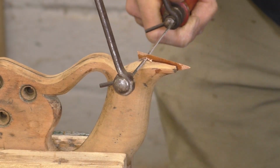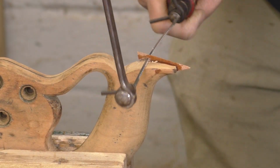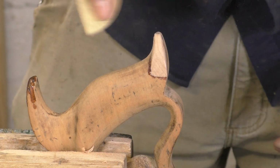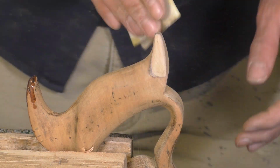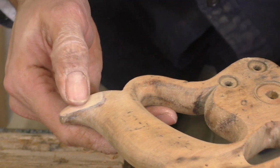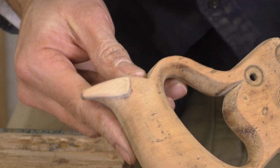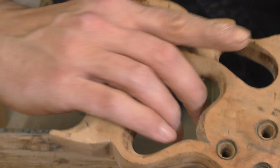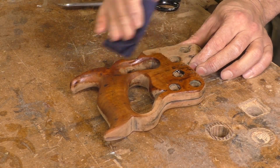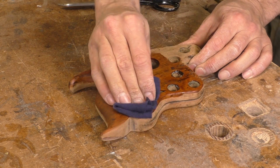It's dry in about 20 minutes, and I can use a coping saw to come right around this curve, chisel off most of the waste, shape it with medium sandpaper, blend it with 220 grit, and I'm done. The final repair is easy to see, but I'm not doing this for looks. My goal is a durable tool that's comfortable in the hand. For tool handles, I always do a two-step finish. Boiled linseed oil is a great undercoat.